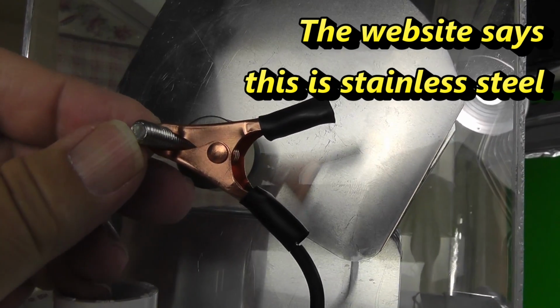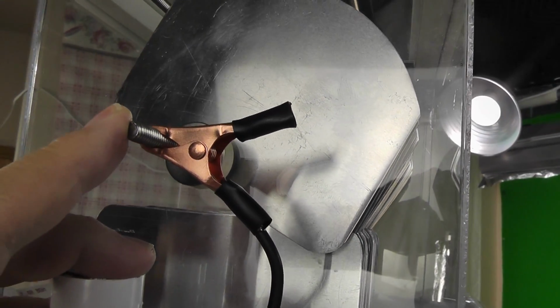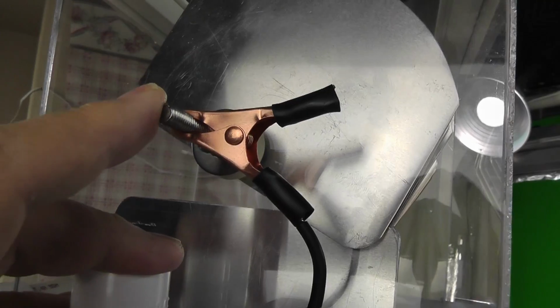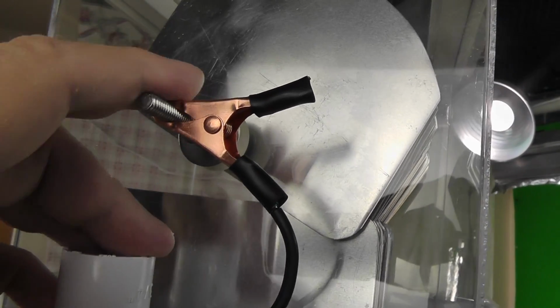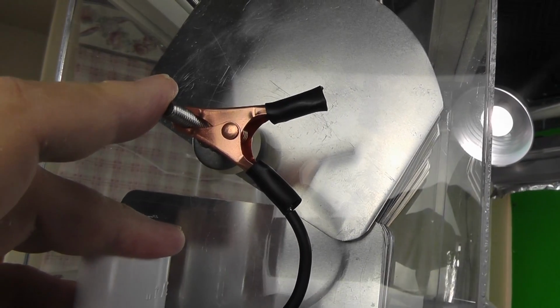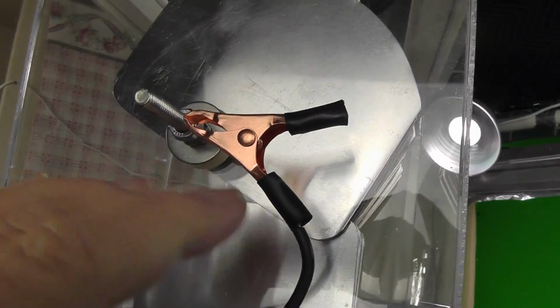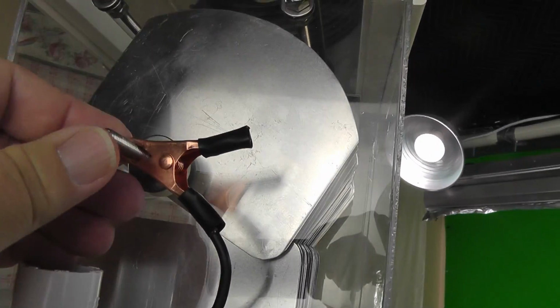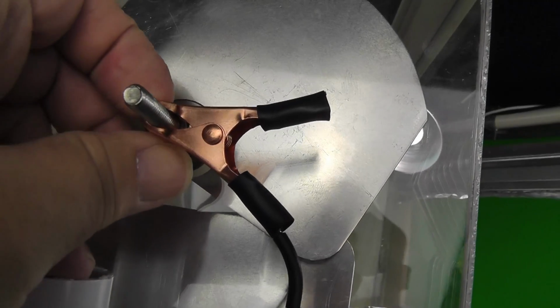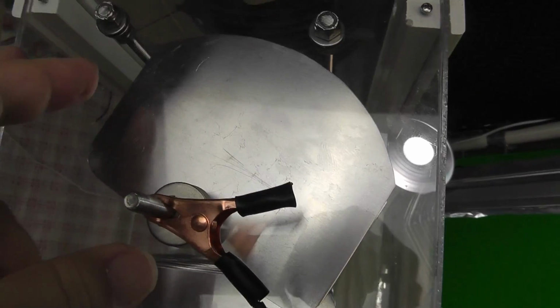and as the capacitor tunes, this slips around on the shaft here. Now, you're going to run into trouble over time with corrosion between dissimilar metals, particularly if you allow this to get wet. So you may want to take that off when you're not using it, and remember to put it back on when you're using it. It kind of rides right in the little grooves of the capacitor.